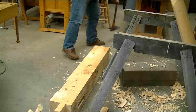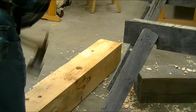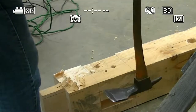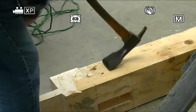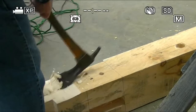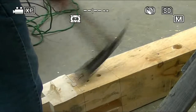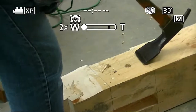I'm going to use my adze. Now I could easily do this just by doing a 45-degree angle back here — that is what I'll call the quick and dirty way of doing it. But this right here gives it a nice radius, and it looks so much nicer. If you look at historic timber frames, this is quite common — as a method for transitioning from the overall dimension of the timber. This is an 8x8, and I need to reduce it to 7 and a half.